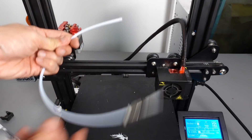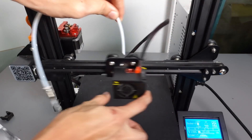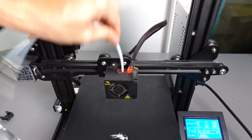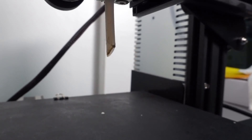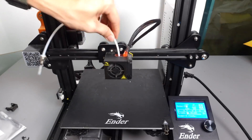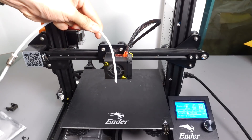So we're going to clean it out — I have a little tip for that. Just use the old PTFE tube, cut it at a 45-degree angle so that you have a sharp end, and insert it right into the hot end. Just double-confirm that it's still hot, and then just wriggle it up and down — it will help to remove and push the gunk out of the hot end. You can see there is some gunk stuck here. You can repeat it a few times until you are satisfied. You can clean up the PTFE tube using some cloth and try it again. I just cut it shorter to use a cleaner part of the PTFE tube to repeat the entire process. Now it's clean.